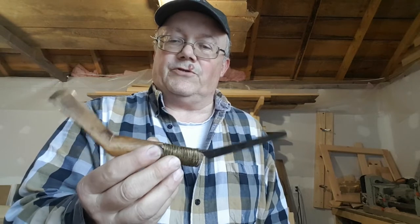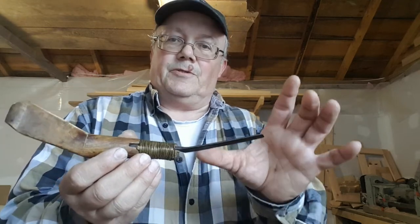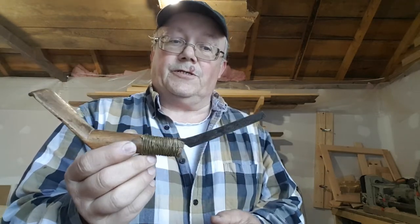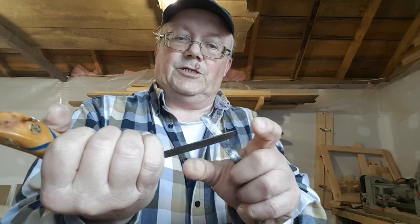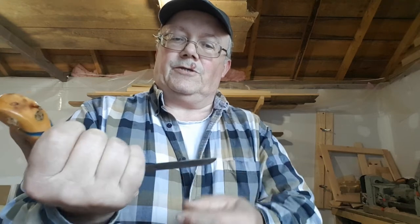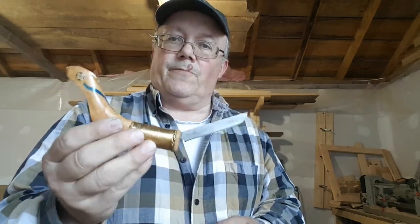The reason was these blades are for small, precise cuts — getting in on an axe handle or snowshoe frame, taking small planing cuts. They're not designed for taking huge shavings or digging big lumps of wood out. This is a craft knife for doing small cuts. The big blades throw the knife off balance in your hand and become very uncomfortable over time. With a traditional small blade — barely three inches long — you can work all day and your hand won't get tired.